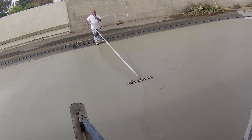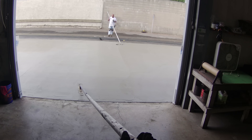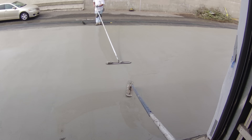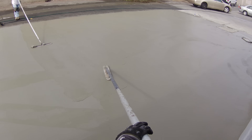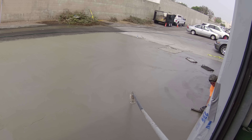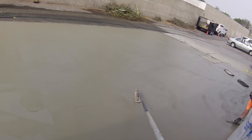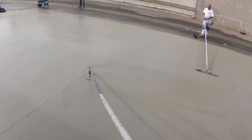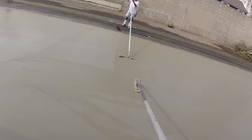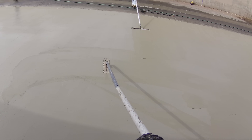This concrete we poured was six inches deep, maybe a little more in some areas especially around that electrical vault. We've got a fresno with weights on it going on one end. We're not going to do any knee boarding on this section — we're going to try to hit everything with poles, funny trowels, and fresnos with Big Blue. The only knee boarding we'll need to do is right along the edge of the building.